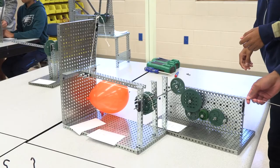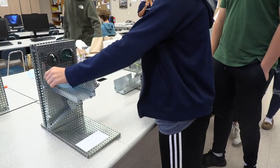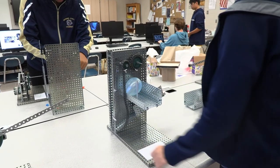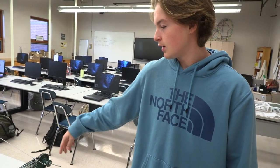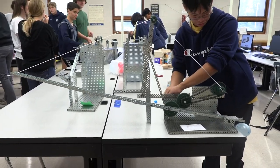The string eventually lets go and drops the pin, drops the lever. Pull on this chain here, and the gears in the back pull the pin up, causing the wheel to go down, hit the lever, and pop the balloon. We started with our gear train and then did our chain and sprocket, which connects to our pulley. We made it unnecessarily large, so you spin the gears a lot and it goes to its maximum — it's super strong but it takes a long time.